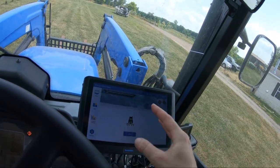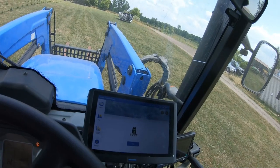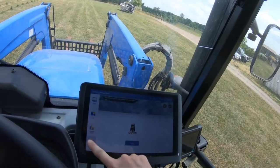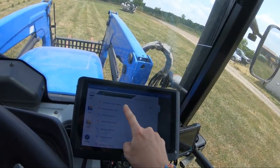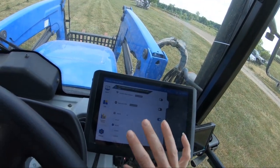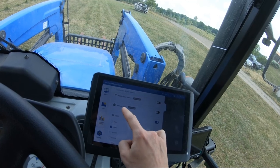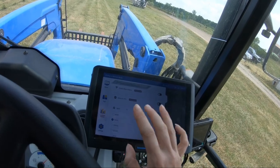One of the biggest pains is restarting the system after every change, because this is going to take a while to link in. If you don't have a base station, a SIM card, or anything fancy, go into Settings and then Correction Signal Source. We're going to use SBAS, and it defaults to WAAS — for the most part that seems to work. The difference is that RTK is going to be more advanced and have a lot more accuracy, but the system should already come set up and ready to go with SBAS.